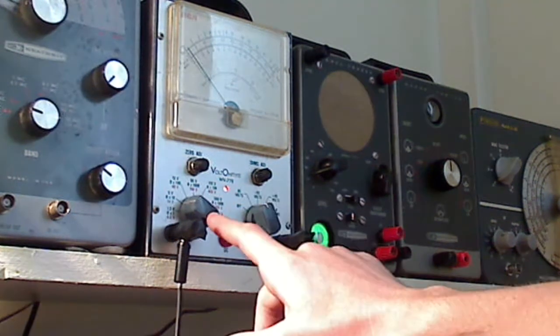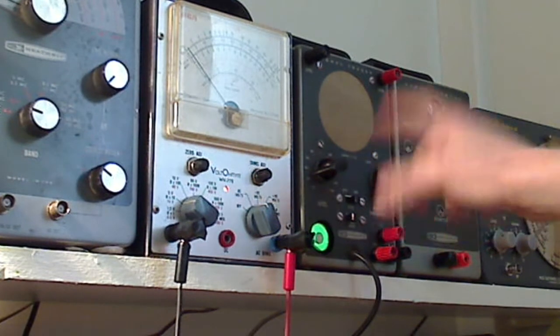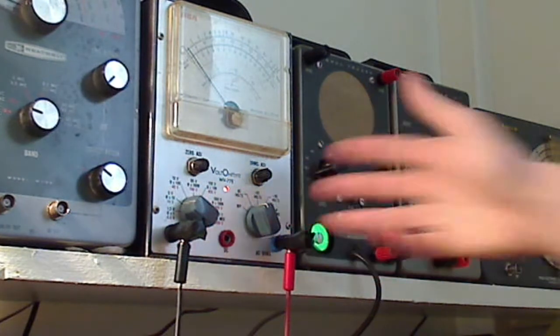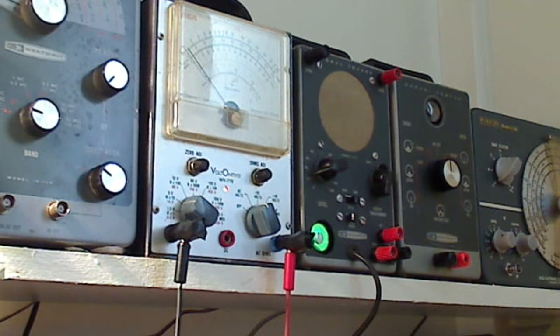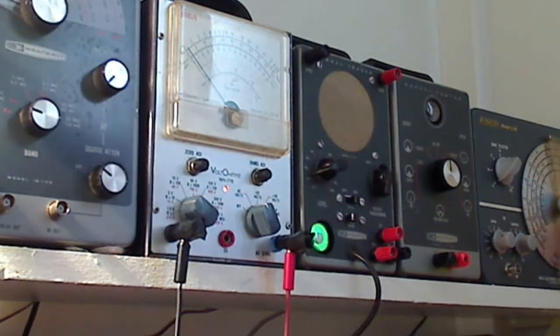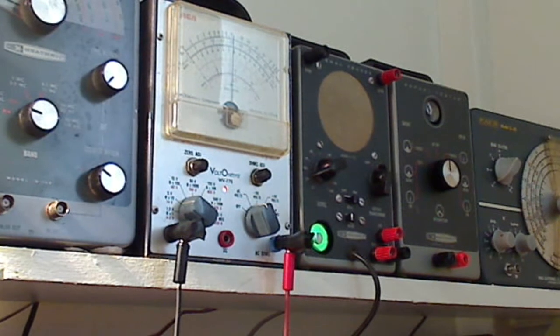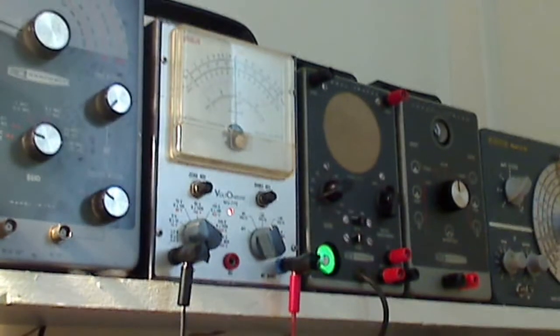We have the polarity right. This is set for five volts full scale, so if the meter reads full scale we have five volts flowing through the circuit going into the tracer. This basically represents our load and we're just driving the meter with the original audio source. We're on the five volt scale, so let's put a 2.5 volt signal into it — that's going to be right at half scale, right in the middle. As you can see, the meter pointer is pretty much halfway upscale. I apologize about the glare in the meter, but that's how we achieve half-scale deflection.